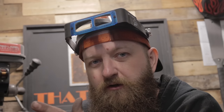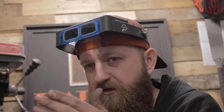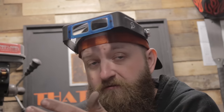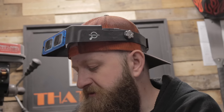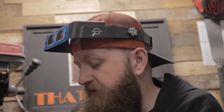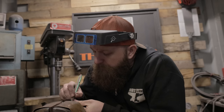I would show them how to do it all on the grinder, get your plunge really nice, use a file guide, all that kind of thing, use a file before heat treat. But I probably wouldn't stress this little detail, because this knife is a very nice knife even if I didn't do this detail. It's a great user. I don't think too many people, if any, would pick it up and gripe about it, but we're going for next level stuff here, and I'm getting judged on it, so every little bit is going to count.